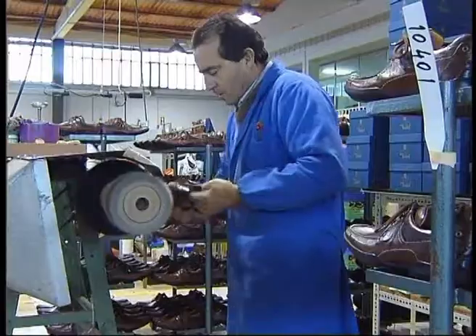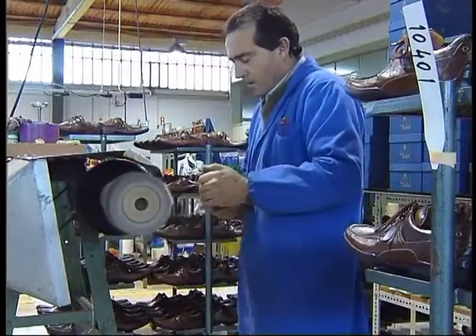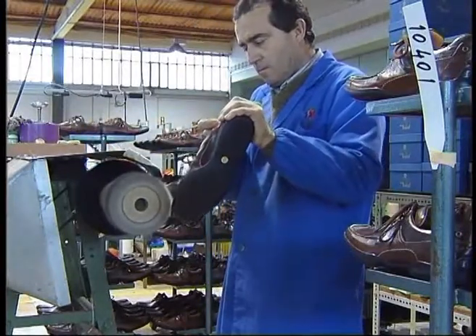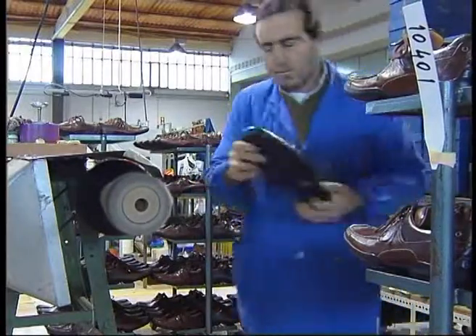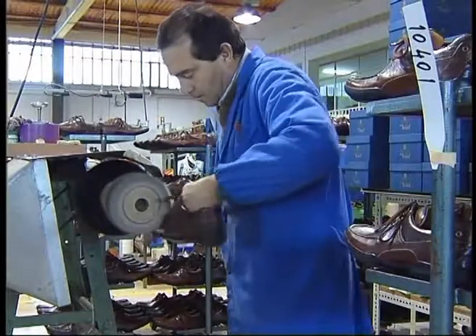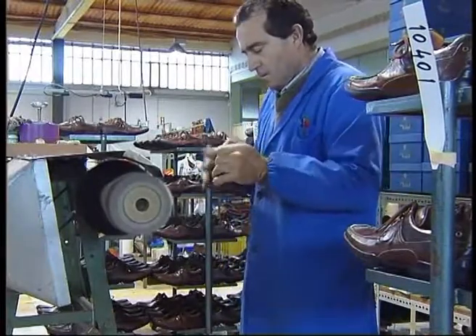To brush the shoe: brushes are very important in finishing because they provide polishing, integrity, shine, and removal of excess finish products. The type of shoe, skin, and remaining operations should be considered, as appropriate brushes exist for each purpose, varying in texture, width, diameter, abrasivity, number of rings, absorption, and hardness. Rotative machines with a manual speed selector are most appropriate, as they allow control of speed, which is very important for obtaining the best results.